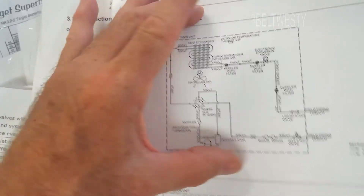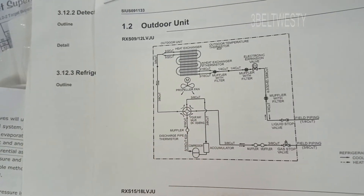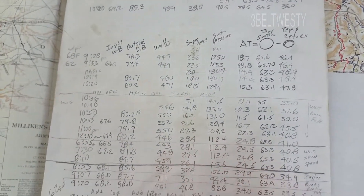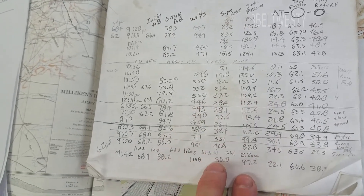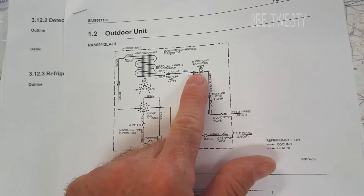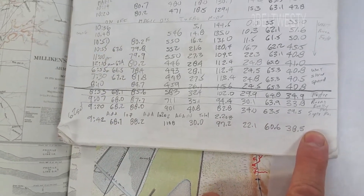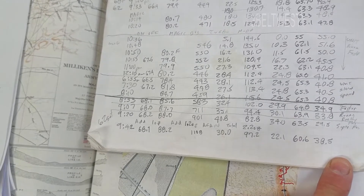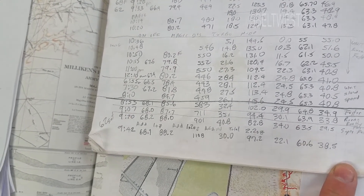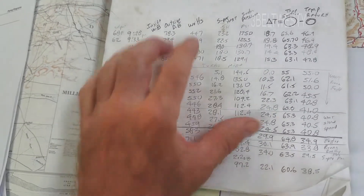If you buy a name brand, a lot of this engineering is explained in documentation. I have a mystery brand here so I'm using bits and pieces from other manuals. When you start measuring the suction line pressure and superheat, it may not be what you think it is. This is true superheat, but you don't really know what this valve is set up to do. Only at full load, with the unit going as fast as it wants and ambient temperature really high, did I run out of refrigerant. The proper way is to reclaim all refrigerant and add back what the nameplate specifies, plus fractional grams for extra line length.